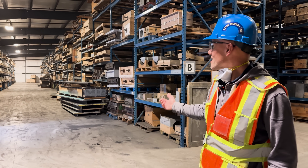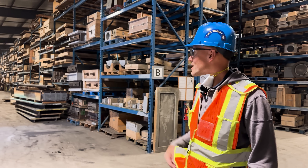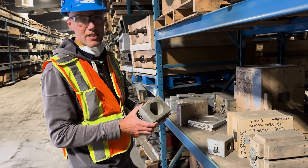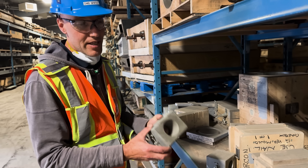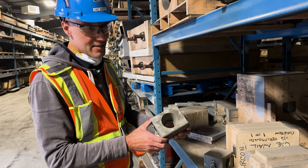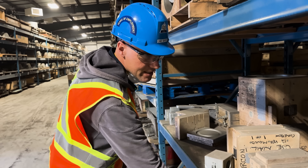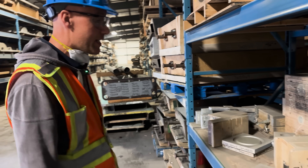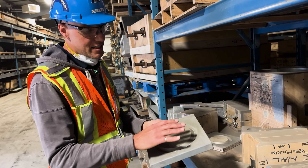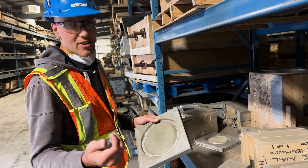This is our pattern storage facility. If you look down the line you can see that we hold thousands of patterns for our customers. Each one of these patterns is used to make the molds for the castings we're making. All these little patterns are cope and drag as well, but they're used to make the cores for the castings we make. They could be anything — this little guy looks like a locator that is used to put in a mold to help line the cope and drag up so they don't have misalignment in the casting. This here is a break-off core.